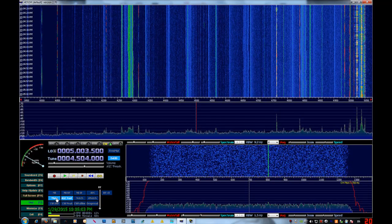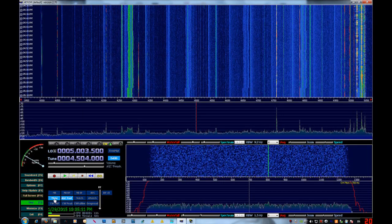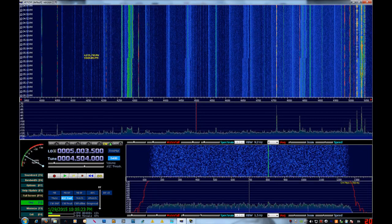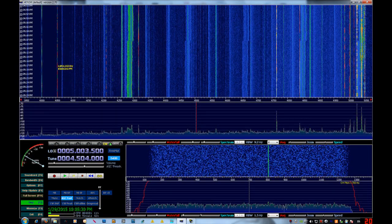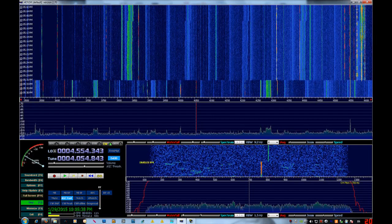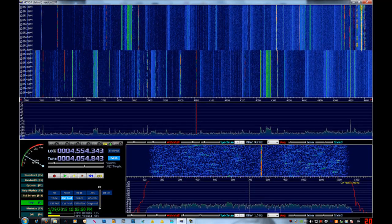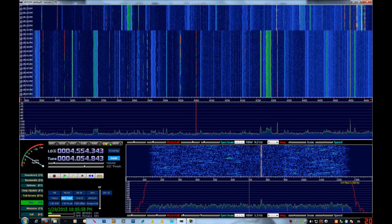Your main weapon, other than visual spectrum and waterfall, is your ears. You can move through a mess like this very quickly — just click, click, click. That's the glory of the SDR, where it excels versus regular radios: using your eyes and ears as a combined force. Let's unmute and listen. Clicking on this signal as tight to center as I can — you can hear nice amplitude modulation. On the audio waterfall you can see the carrier, and to the side, the audio information causing the carrier to deviate into the sidebands — standard AM.